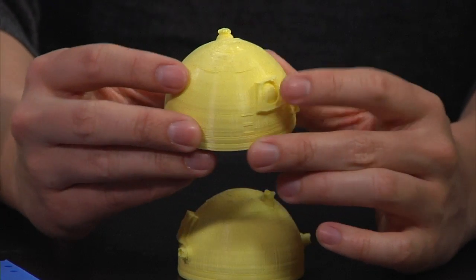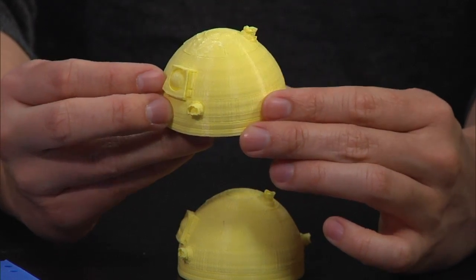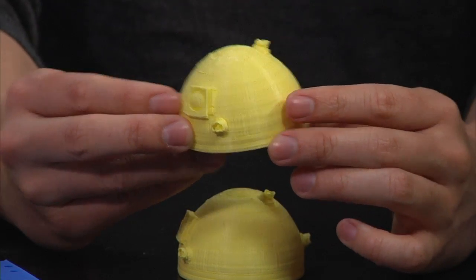Yeah. So before we move on from the plastic, you can use PLA in the Replicator 1, or you can use ABS. As long as you have a heated build platform, you can use ABS relatively easily. It's difficult to use ABS on a non-heated build platform, especially to print large stuff. So that's the big difference. That's why the Replicator 2 is a PLA-only machine, and the Replicator 1 you can put whatever you want in. And in terms of temperatures, 220 degrees? 220 for ABS. PLA melts anywhere from 180 to 210. It starts to scorch if you get it much above 230.